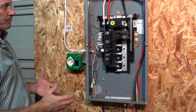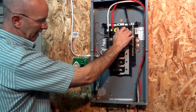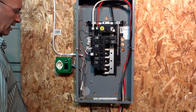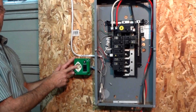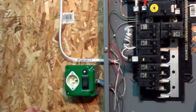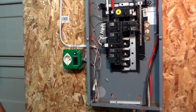When you lose power you don't touch any of this. Turn your main back on and turn all your breakers back on — this is all closed up. When you lose power, come over with your extension cord and plug it right into this inlet. It's in normal mode. Switch it to generator — that's all. You do not touch anything in the panel. When your power comes back on, remove your cord from the generator, put the switch back to normal mode, and you're complete.